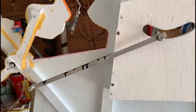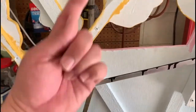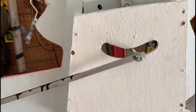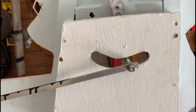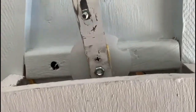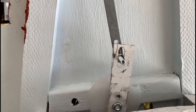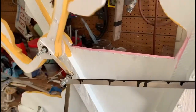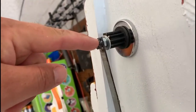Now, from that single pivot point, it goes to another pivot point that he's pointing to. That goes to the clock arm, and the clock arm is going back and forth. Again, the pivot point is fixed onto the bottom part of the arm, and then at the top part you have a loose connection that then goes up to another point at the top. So this whole thing is run from one single motor, just using different points, points that are either welded solid or loose. And that allows you to get full motion effects that you want using just one motor.